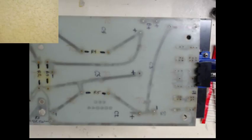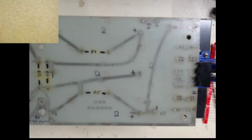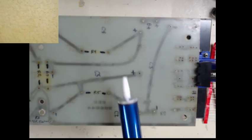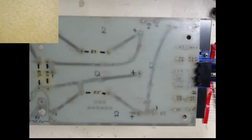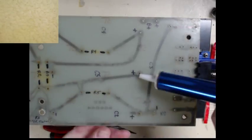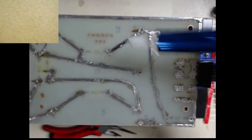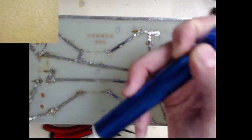So, for example, to get started, I have handy a pair of plain old regular scissors, and a converted dental pick I use for holding parts down or making sure things are okay. And for mistakes, yep, we'll make them, a solder sucker, pretty easy to use. For those who have never seen one, you just push the plunger in, set it on the spot you want to remove your solder from, and hit the little black button, and it will pull your solder away.